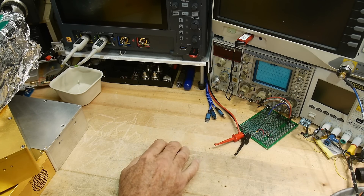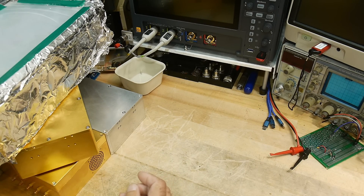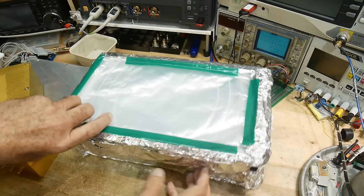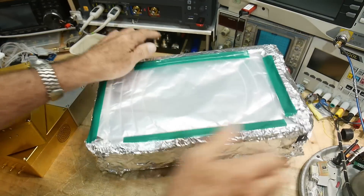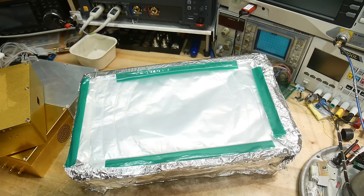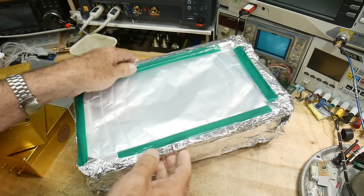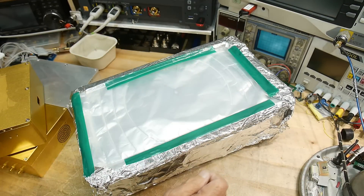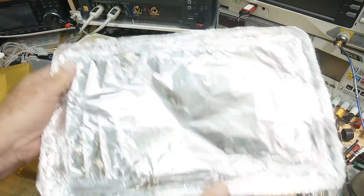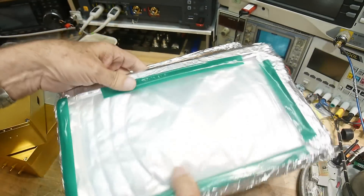I said I can't use oscilloscope probes, because they have these ground leads. So maybe I'll need to have hardwired coaxes and stuff. Still not getting there. So then I built myself a Faraday cage. I got some Tupperware and some aluminum foil and put that together. Too much noise. I discovered that I wasn't getting a perfect seal all the way around the box — the metal wasn't making contact everywhere. And what happened was the top of the box started acting as an antenna. It would pick up noise and then retransmit it into the box. So that wasn't going to work.